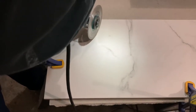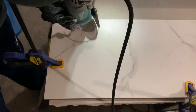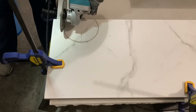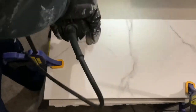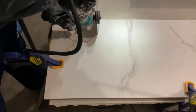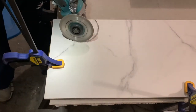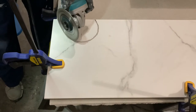I took the cover off my blade because I wanted better visibility. I'm not pushing down hardly at all — I'm letting the saw do most of the work. It just kind of takes over. You just want to make sure you control it so it doesn't run away or start moving in a direction you don't want. In terms of depth, it sits very lightly on top of the tile and you're going to make a few passes just to get your line kind of chiseled out.